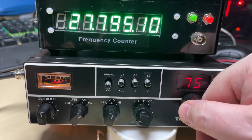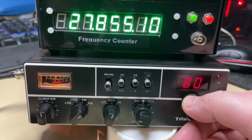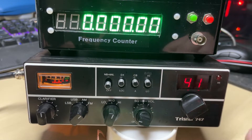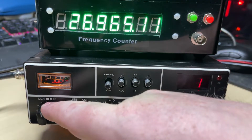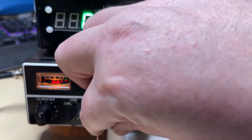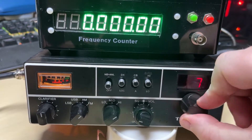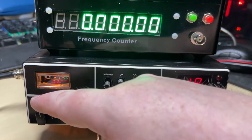Here's how I've got the radio configured now: CB is normal, I've painted out the P on PA so A is for alpha, and I've painted out where it says tone so we've got high and low — high is fives and low is zeroes. I've got the UKFM on the band switch, so that's now a four-way band switch with an extra band off high to the right.